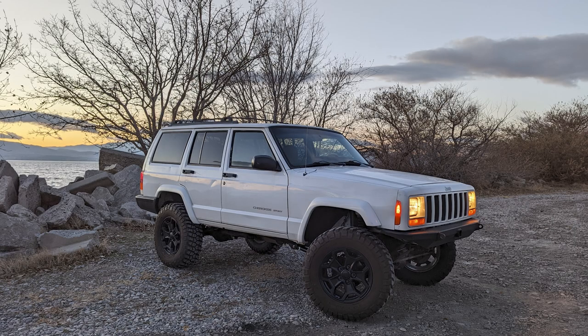Hello and welcome to Engine Adventures. Today we are going to go over the center section of the frame stiffeners. These are from Iron Rock Off-Road, and the XJ is a very lightweight vehicle all around. Even though this is the updated one — they did a refresh in 97, this one's a 99 — with a stronger frame and stronger unibody, it still needs some frame stiffeners to stiffen it up and make it better for off-roading. If you're going to be doing a bunch of off-roading where you're twisting the frame, getting articulated and all that, you're going to want to add frame stiffeners.